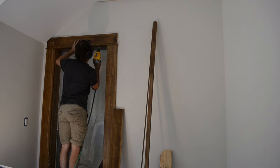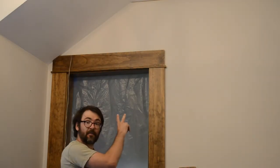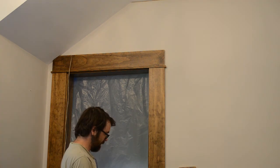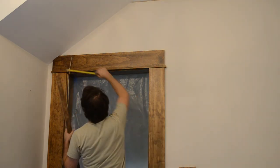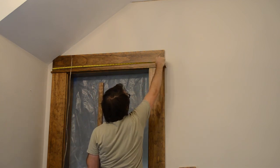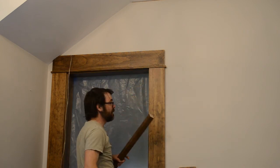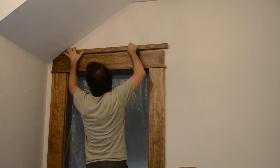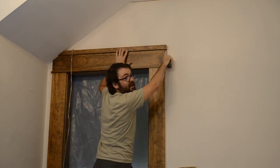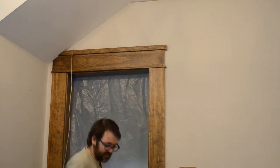The next piece is the two-by-two cap, which is actually one-and-a-half by one-and-a-half inches. I've stained it on three sides. For this style you want an inch hanging over either end — so if the door is 41 and three-quarters, you cut this at 43 and three-quarters. Mine is a bit different because of the stairway angle, but on a normal doorway you get an inch overhang on both sides. This gives it a staircase of chunkiness going up that looks quite nice.